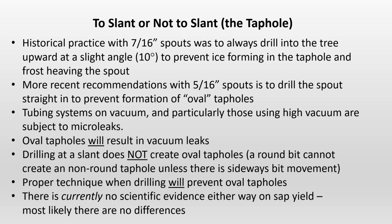When tapping, if you hit dead wood and then you find good wood, within what distance should you be concerned with sucking vacuum, sucking air through that spot where you tapped in? Because you had some good wood, or at the end you hit a little bit of dead wood. Should you plug that off? You should absolutely worry about it.